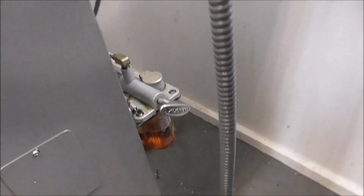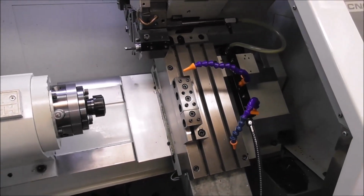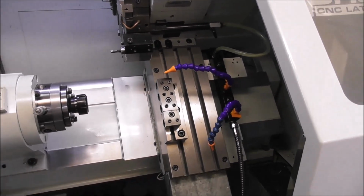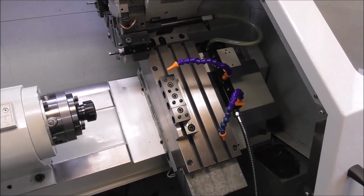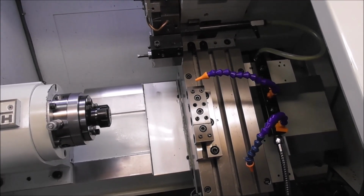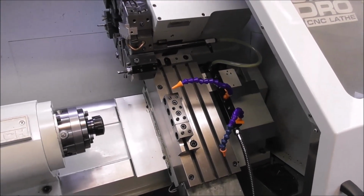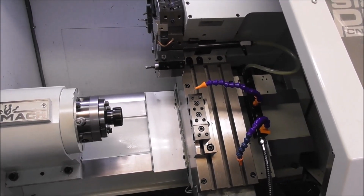you've got pressure lube coming from the inside. You know, in this case you've got this pressure plunger and oil lines feeding inside the slideways. They should be pushing oil out and blowing out any chips and keeping it lubricated, and you'll never have any problems. Well, that's great in theory, but the reality is that all of those oil lines don't always work properly. Some of them feed the area really well and others don't. And some areas that aren't important get all the oil, and other areas where it's the most important don't get enough oil or don't get any oil.